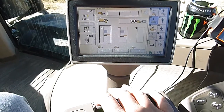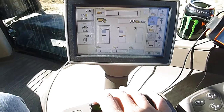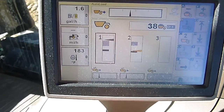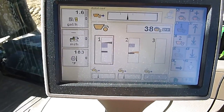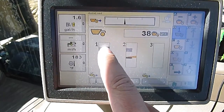If I raise the scraper up, that arrow will move. Now right there, we're in the highest up position. These cans have accumulators on them, so for ride height we want them down an inch or so so that the cylinder's got room to float. So we just put that wherever we want to put it.